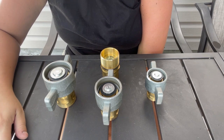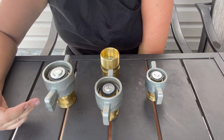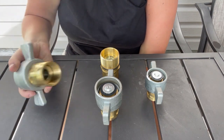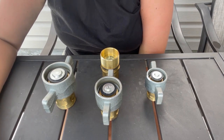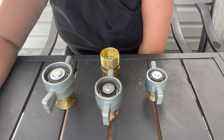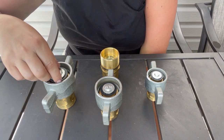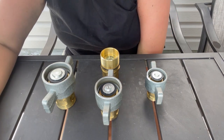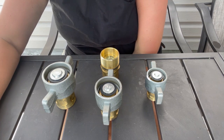Can they be rebuilt? I've actually never been asked that question, because most of the time the customer brings me a hose with the quick coupling on the end where the pipe has galled itself to the threads on the quick coupling and you can't get it off — so you have to sell them a new one. Nobody's ever asked me for a new quick coupling because it was leaking. I'm going to say no, they can't be rebuilt, because there is just a little thin washer in there that does not come off. So if it is leaking, you just need to bite the bullet and buy a new one.